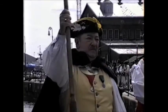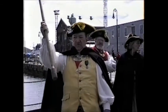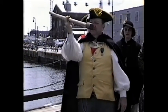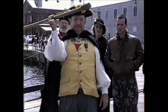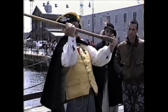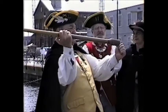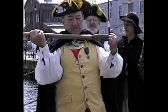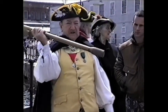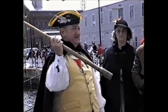Okay, I mentioned a red stripe. This particular red stripe is placed appropriately so that with this ram all the way down the barrel on my piece, this red line will be at the very end of the barrel. If there's something down that barrel that keeps it from bottoming, that stripe is going to be further out, so you can see the red stripe. You know there's something down there. If it's right at the edge, you know it's clear. Okay? Several of my instruments have the red stripe on them. The rammer is by far the most important, simply because the rammer is the first piece used to verify that the barrel is clear and that there's nothing down there.